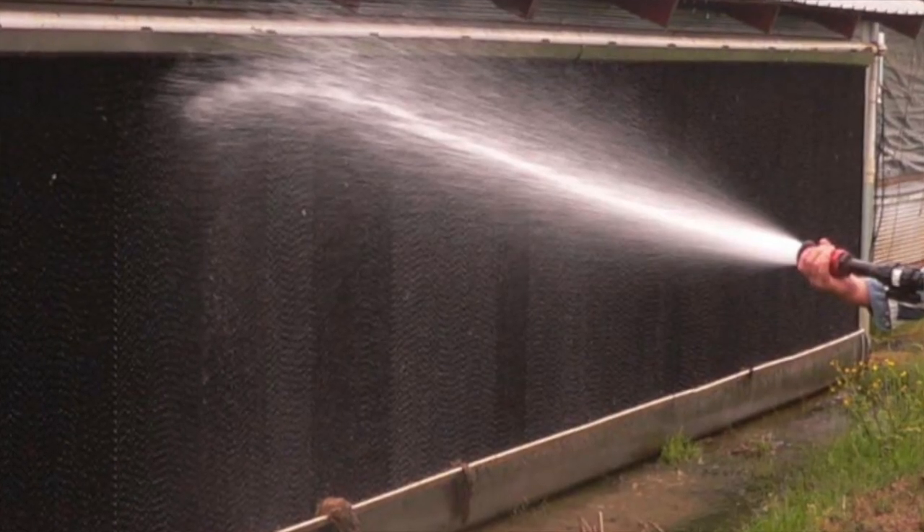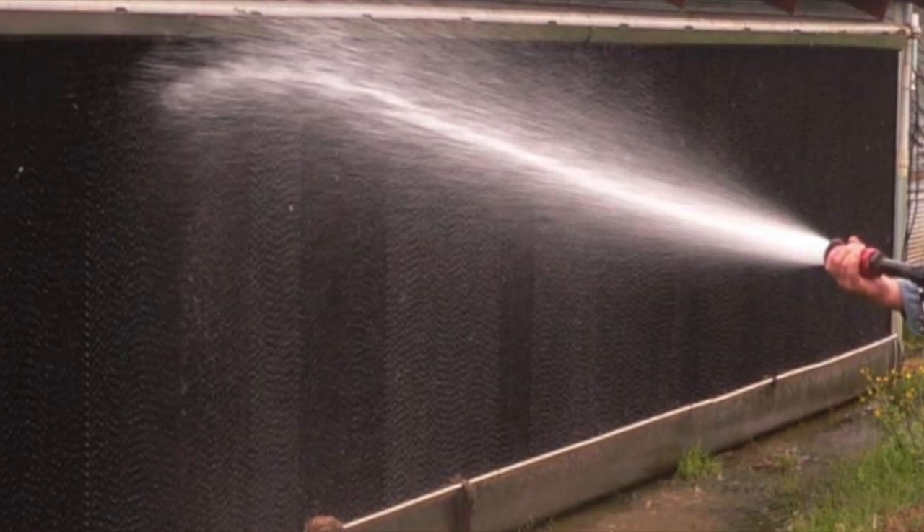All of that's really important. If you're running in the heat of the summer, it might be every week or every two weeks. In these shoulder seasons, as it's running just part of the time, you can probably extend that out to maybe every two to four weeks. But once we get into the heat of the summer, the plan should be to flush it pretty regularly to try and get that buildup out of those lines.